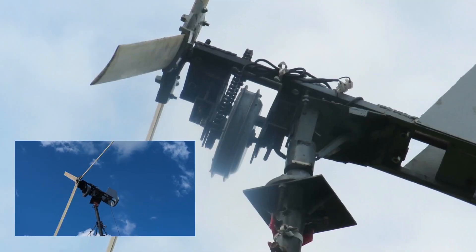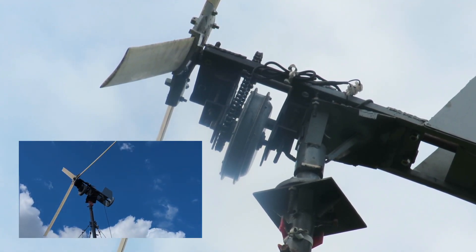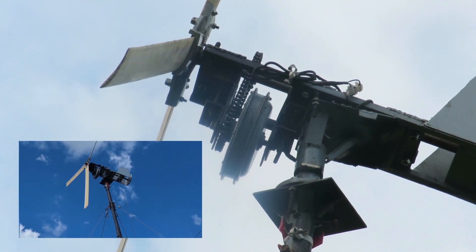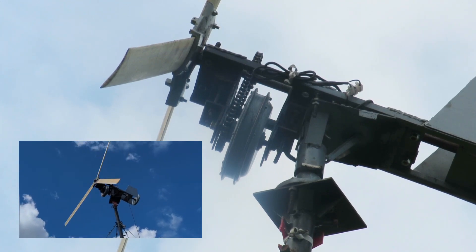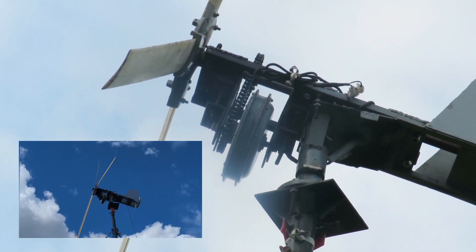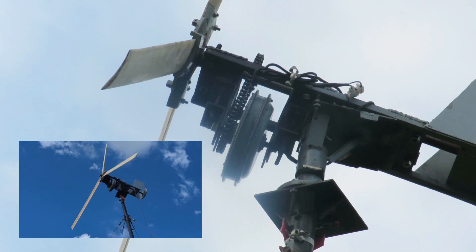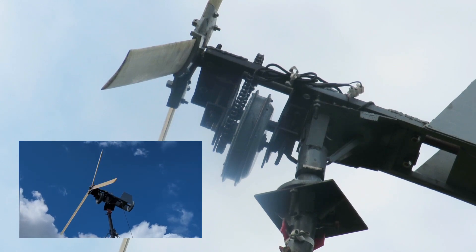The thing I really love about this motor is it's designed to work at a fairly low RPM. If you consider a treadmill motor that works at 3,000 RPM, that makes a really rubbish wind turbine motor, whereas an electric bike motor that runs at 300 RPM will deliver you a lot more power and it's a lot better choice as a wind turbine motor. The downside of this motor is it's actually very hard to turn — if you held the motor on either side and tried to turn the spindle, it's very very hard to turn.